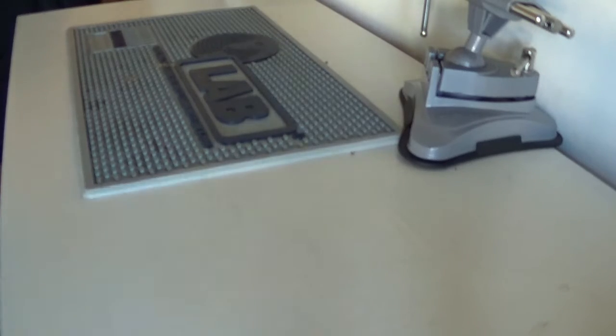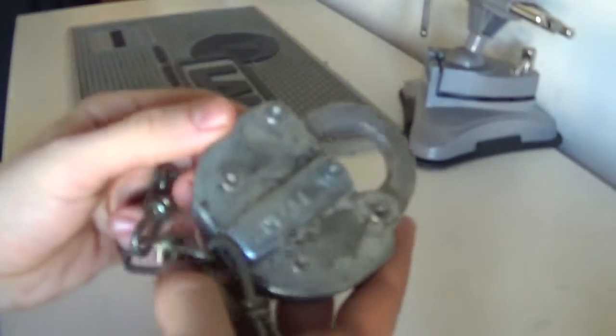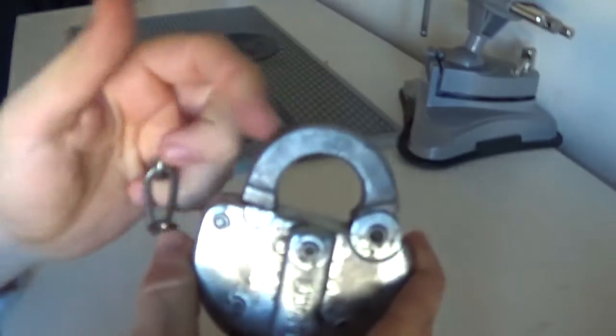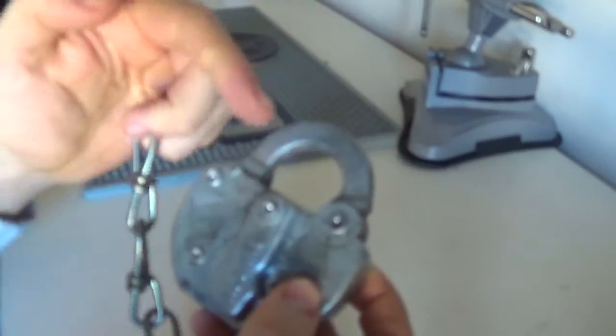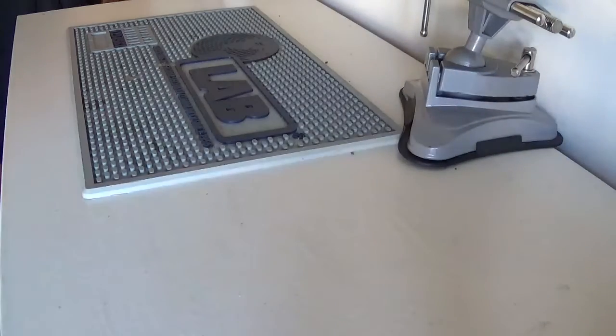Here's another design that I think is outdated — this Adlake. It's a lever lock but it doesn't have any levers; I don't believe it has any. It has a very strong spring and again if you just cut the one side the thing opens. A modern lock should require two cuts, and this spring holding the thing closed is not in my opinion up to securing valuables anymore.